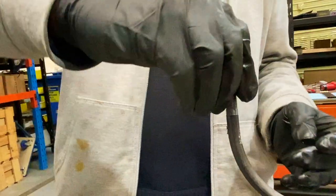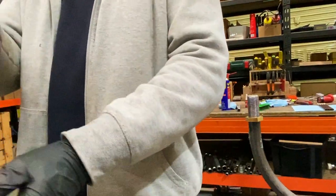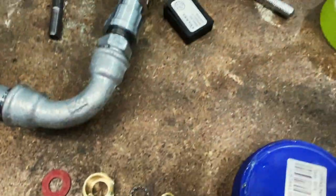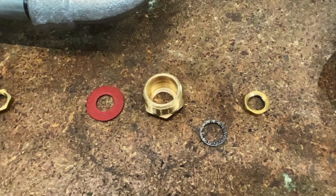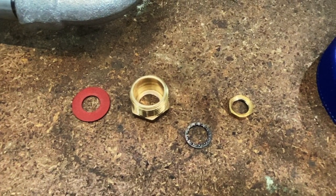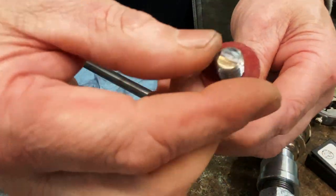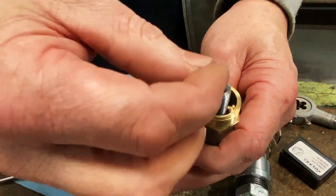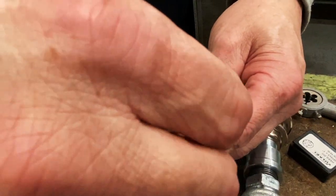The first nut goes on to hold one side. We've also got another nut on the inside of the plumbing pipe. What we need is a plumbing pipe compression fitting, a washer - a star washer - so it doesn't come undone after we've done it up. Then a nut, a fiber washer, a compression fitting, a compression washer, and then a modified nut - one that's got a bit of a taper on it.